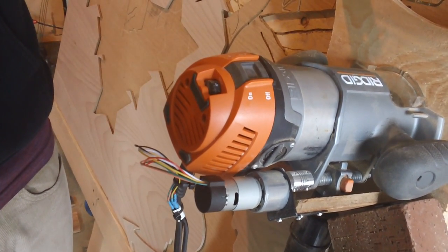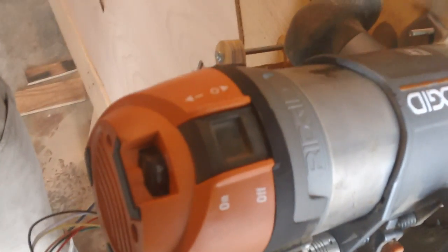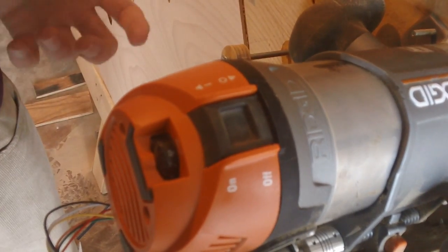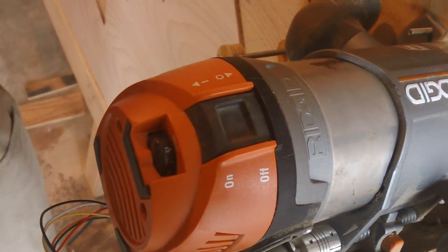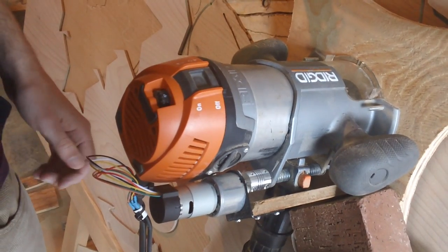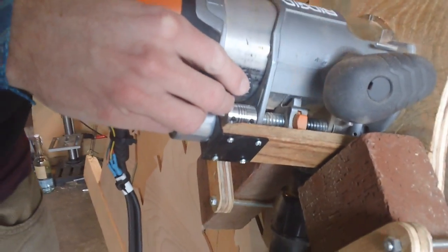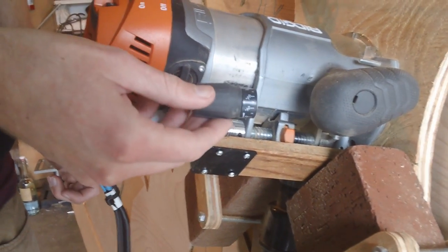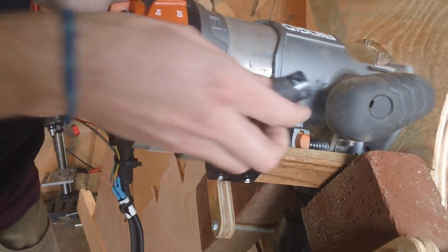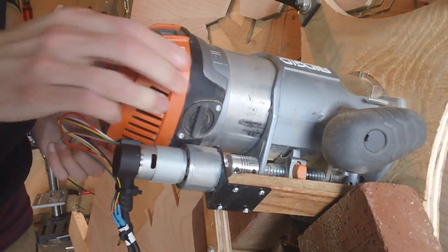The next feature I really like is the on/off button right here on the top. You pull it out to turn it on and hit it to turn it off — it's sort of like the emergency stop button on big equipment, very accessible. The depth is also very easy to set using a screw along the side, and before I took it apart and mounted the motor it had a knob that was very easy to adjust while using it. It's also very easy to attach a motor to and very solid — nothing is loose.